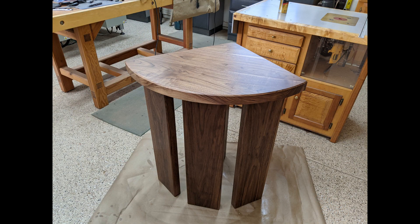Here's the final table. I finished it with Minwax satin polyurethane, which I use on almost all of my projects. I wipe on two or three coats with the wipe-on poly, sand with 400 grit in between, then spray the last coat or two with aerosol cans of the same product. I prefer the satin finish — gloss doesn't look right to me on wood unless I really want a flat, pore-free surface, in which case I'd use semi-gloss. Satin also seems to dry a little faster and is easier to sand correctly.